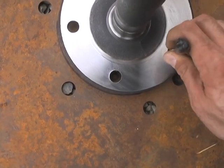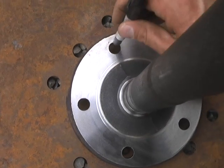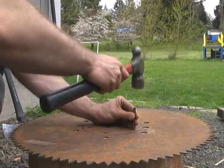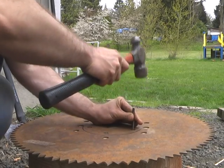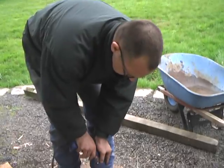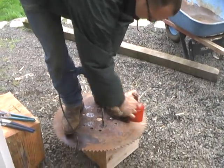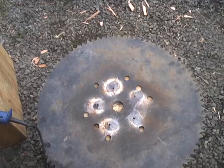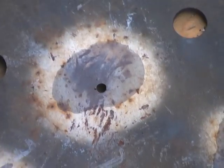This way I can drill it by hand — I'm not going to do any welding. With a punch, just to make sure I get my holes straight, I'm going to mark where I want my holes to be drilled. I had to heat up this steel saw blade with a propane torch so it got bright red on my holes because this is hardened steel. Now that I've heated it up and let it slowly cool down, I'm able to drill into it. I'm adding oil so it doesn't burn up the drill bit. I flipped it over and I'm going to hit it from the other side — this is extremely hard to drill through.